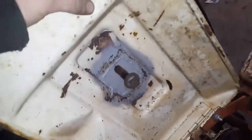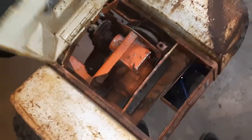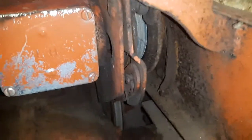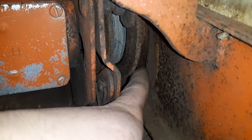On the shed I think we have some better seat pans, because this one's been booger welded on the bottom pretty bad, so I'm not sure how good the hinge is gonna work. When I restore this one I'll probably do like I did my G16 — take the fenders off, all the white comes off on bolts, pull the motor, pull the front axle. I'll probably leave the transmission alone because this thing's got that variable speed. Looking at it now, the drive disc is worn out — you can see it's all beveled over.